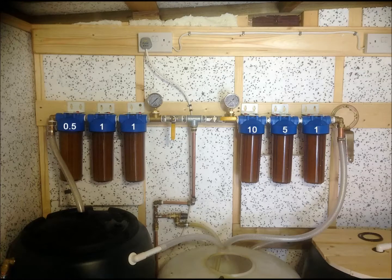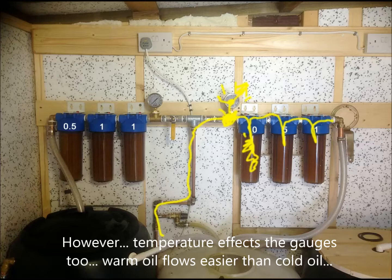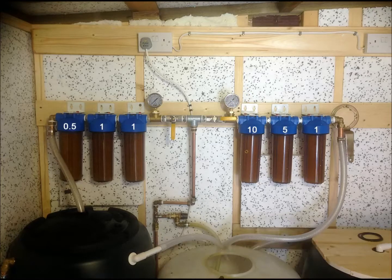If you're eagle-eyed you might have spotted these gauges at the back here. They are just a means of keeping an eye on the filters. What they are is they measure the pressure that goes into the filter — this one is a 7 bar and this one is a 4 bar. The oil comes up from our pump, comes along, and goes into this filter. Because these are mechanical filters it's going to struggle a bit, so pressure builds up and that's registered on this scale. Once these filters start to get all gungy, that pressure is going to increase and we'll start seeing a higher reading on our pressure gauges. That's why we have a pressure gauge — you just keep an eye on it, and when it's higher than normal you know your filters are dirty and need changing.